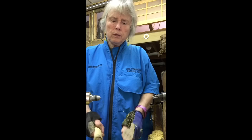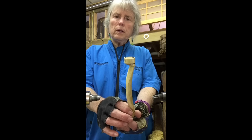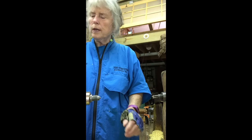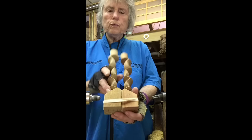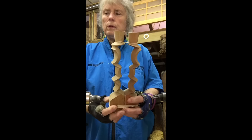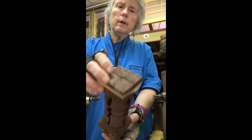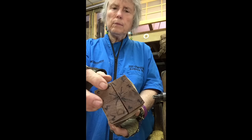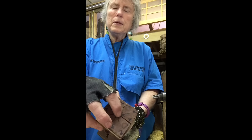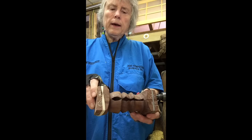One other idea I wanted to share with you in this video is that any spindle you can make in quadrant number 1, which has parallel axis and arc type, you can make as a split turning, either putting two pieces of wood together and rotating them 2 or 4 times, or 4 pieces of wood together and rotating them 2 or 4 times. The only constraint is that you use the very center of the pieces as the axis that you turn them on, and they become parallel.